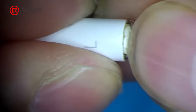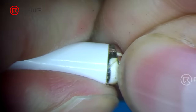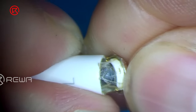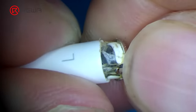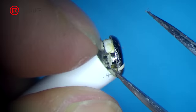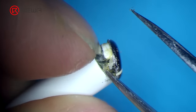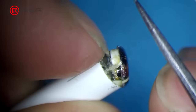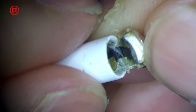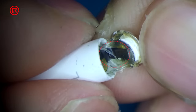Pry up the metal cap from the side with an L-tool. The back of the L side has a flex cable — please do not damage it while prying. Remove adhesive with tweezers. We need to continue heating the AirPods while removing adhesive, and pay close attention to the black flex cable throughout.